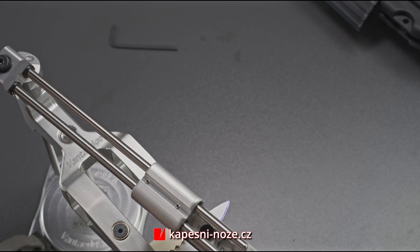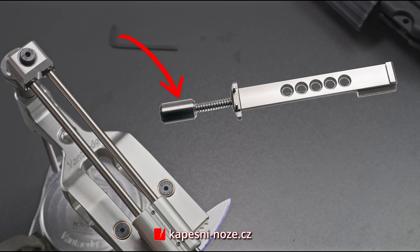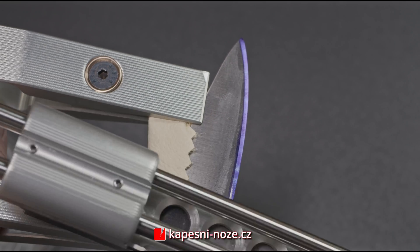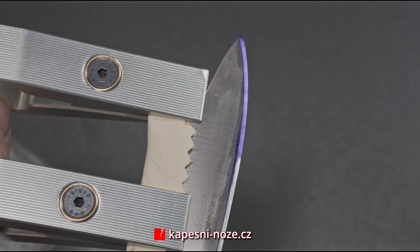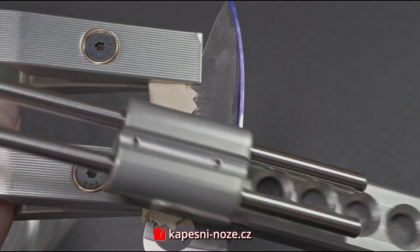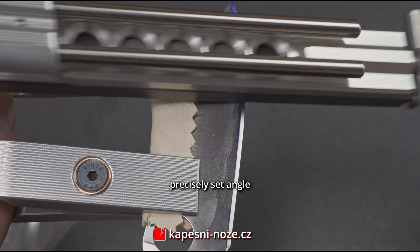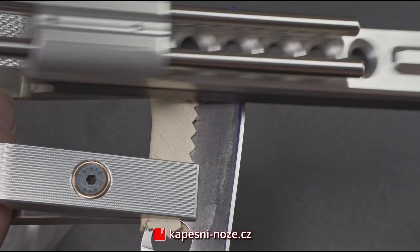The holder contains a cylindrical head located right behind the spring. By holding this cylindrical head we are able to easily begin the sharpening process. After mounting the head we let it sit with its full width on the blade. By doing this the angle head will pop up to a slightly higher position, which ensures a precise sharpening angle. The stone is then moved along the blade in an alternating motion.